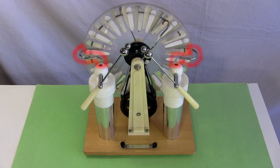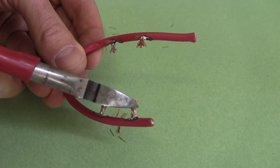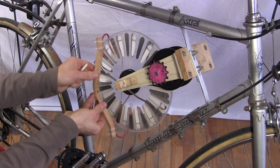The old collectors were previously directly connected to these two Leiden jars, but that won't work here since now the Leiden jars are up front and the collectors need to be at the discs. So I make some new collectors by soldering sharp wires along some insulated 10-gauge wire and attach them to a piece of wood. They then go on the disc assembly.